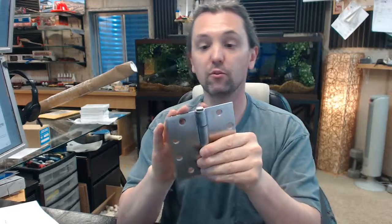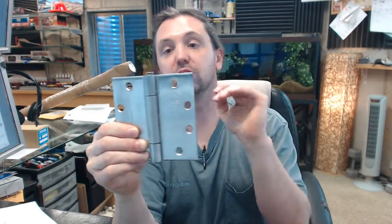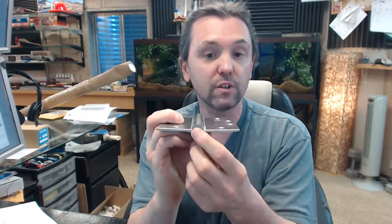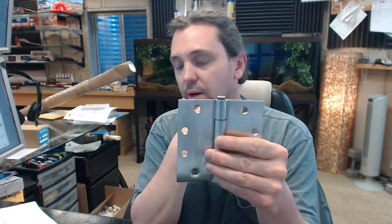This is a non-rising removable pin. Regarding the pin options: because this is considered non-rising, meaning it won't creep out over time, it generally does not. It can obviously be removed by driving a nail or something through there to drive the pin out. Options for security would be a non-removable pin — drilled and tapped, a set screw goes into the base of the knuckle. A groove is cut in the pin so that when you seat the pin and tighten the set screw, it all but prevents that pin from coming out. I've tried to get into a door that had that set — they don't come out, not without being really determined.